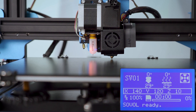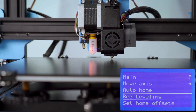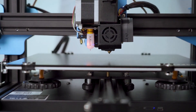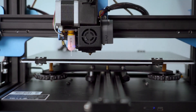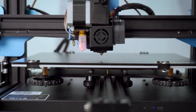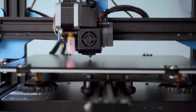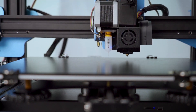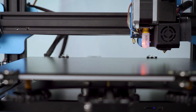After that, disable the stepper motor so that you can move X and Y. Pull the paper to find the nozzle distance by tightening or loosening your leveling nut. Please do the same process on all four corners. Some people may have confusion about setting Z offset — I will show you how. If you cannot see the bed leveling option on your LCD, that means you haven't installed your BLTouch yet. If you don't know how to install BLTouch on the SV01, we have a video for that with a link in the description.